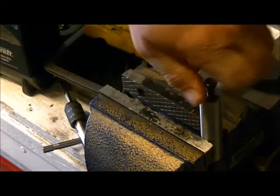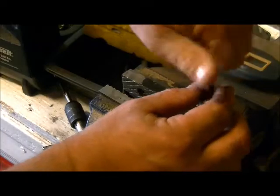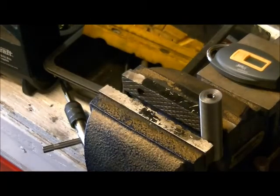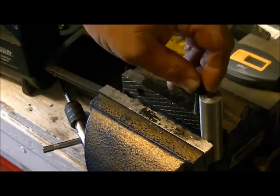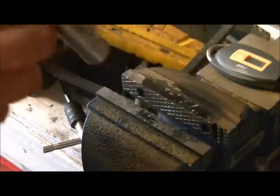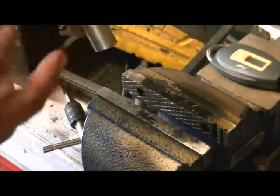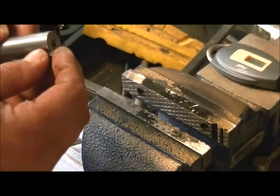So in this case, we're going to cut the bolt down in size a little bit on its length, because we don't need all this length anyhow. So what we'll do is we'll basically chop off maybe about a third of that bolt, because it's still got to have good clamping force when it goes down. This is why it's important to measure and make sure you got it. But you're not always going to have a perfect run at it, that's for sure.